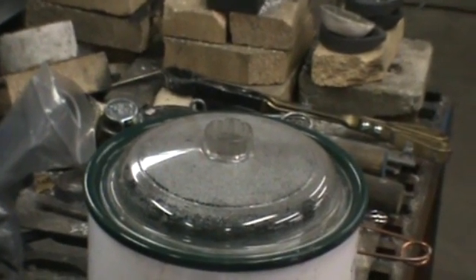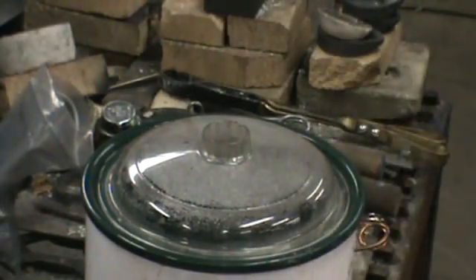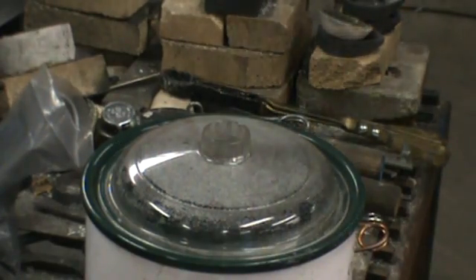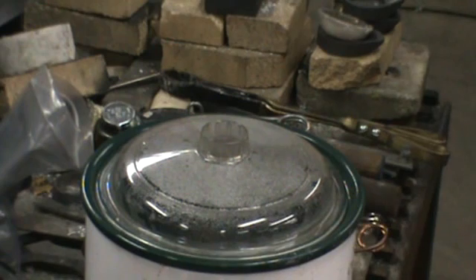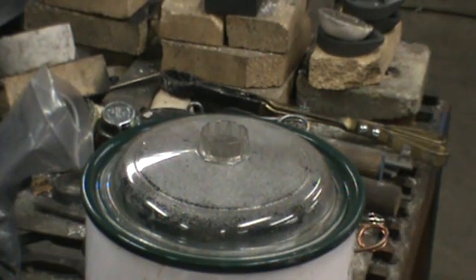I've made a glob of silver in the mold and I'm going to go ahead now and put it in the pickle. I've got to get it out of the mold. She's pretty ugly. You put it right in the pickle hot. This pickle is probably just about coming up to temperature. I'm going to let it sit and stew in the pickle for a few minutes while I get the next little task ready — which is going to be using the pickle to quench when you anneal silver sheet or gold sheet.